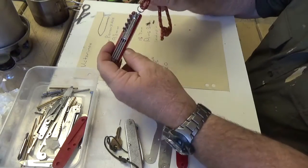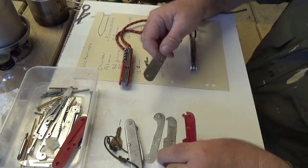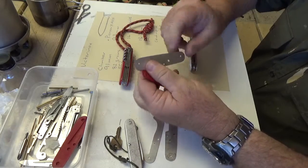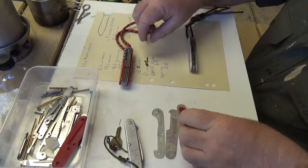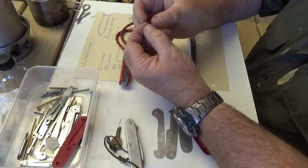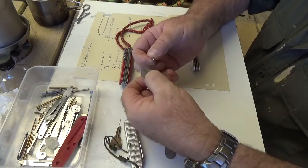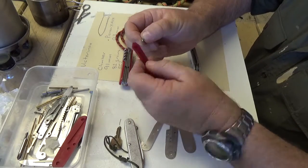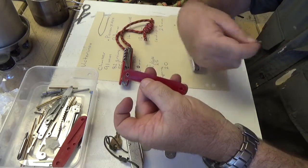Anyway, for those of you that have never taken one of these pen knives apart, they're basically a sandwich arrangement of an aluminium side plate, a cover over the top, and various spaces between whatever tool set the knife carries. Okay, so on the Climber, it has two sizes of pins, and they are secured by crimping a very small collar in place, and that collar sits on that side of the plates. It's obviously just stamped with a press. Now these collars also provide the anchor for the side plates, just like that. You guys can see that there.